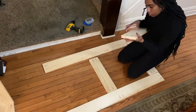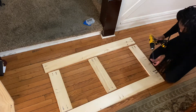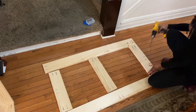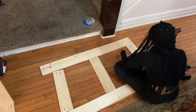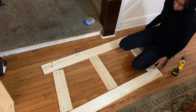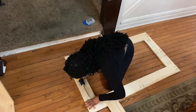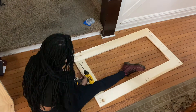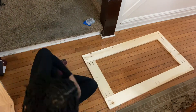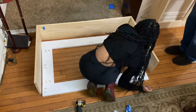So as you can see, we cut all the pieces for the frame and now we're just going to put them together using my drill. And this is why I said that pocket holes are best friends — once this is all put together there's not going to be not even one nail in sight, which is going to make this radiator cover look so much better. Also shout out to my bestie.